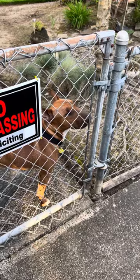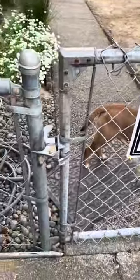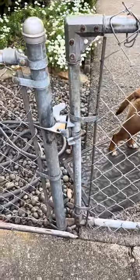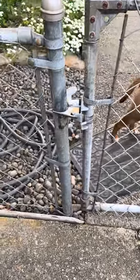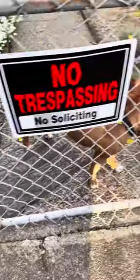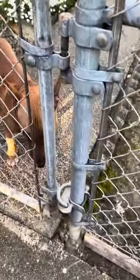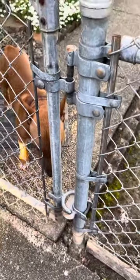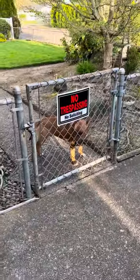That's the tip. If you look hard enough through your local fence company, you can find this type of hardware. It may be a special order, but if you talk to a fencing specialist in your area that owns a fence company and is knowledgeable in fittings, request a gravity-style hinge with a butterfly latch, and you can have a nice gate setup that closes automatically.